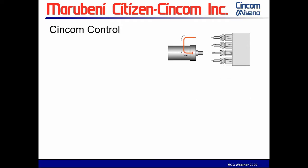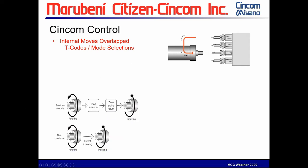Now, something else we do is overlap T codes and mode selection. In this case, if you're changing tools from the machining data, the machine knows how far it needs to clear this tool, what the diameter of the tool is, so it doesn't have to retract all the way back, come across and retract in. It can make a nice flow to come around and just clear it. So it's a minimal amount of distance it has to travel. It also does it very smoothly, very rapidly. You can save a fraction of a second, but those fractions of seconds add up over time.